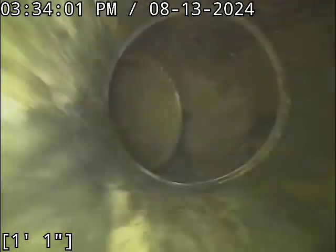You drop down here — I'm not going to push all the way through it because the configuration is very hard on the camera. You go through a myriad of hard turns. Once you push past this Y-connection here, right down the line, right up ahead is the vertical column that the pipe ties into. If we pushed about two more feet forward and you looked into the floor clean-out, you'd see my camera head sticking through that tie-in there. I can tell that because I can see where all the grease is coming out of that connection.